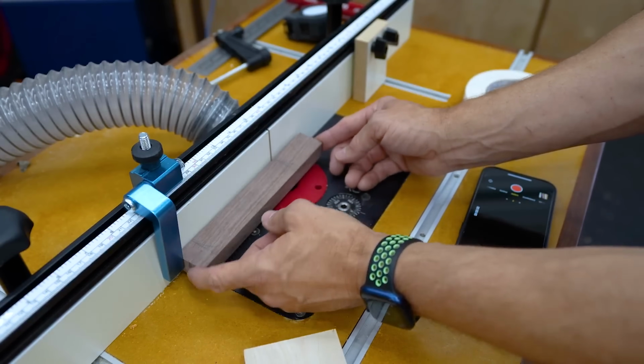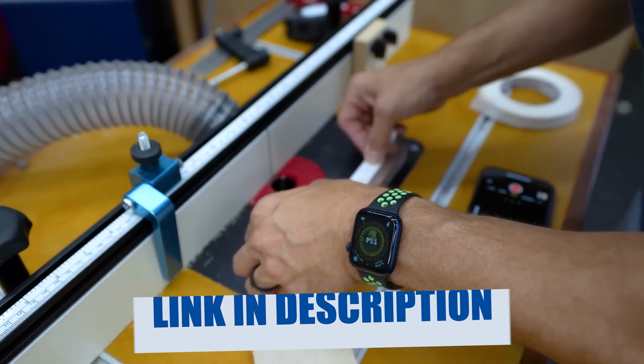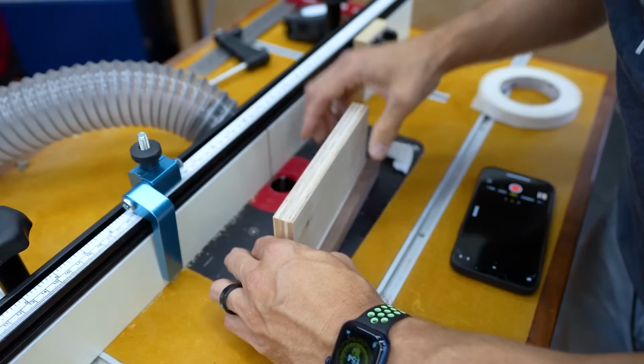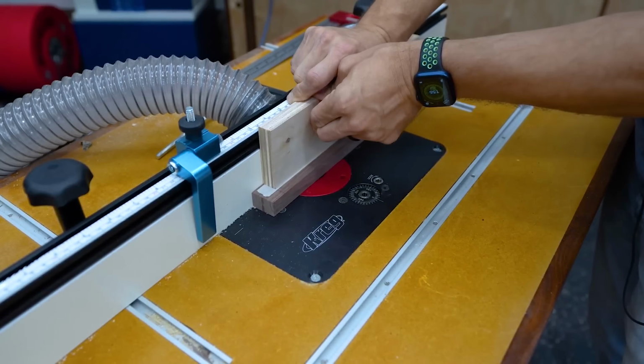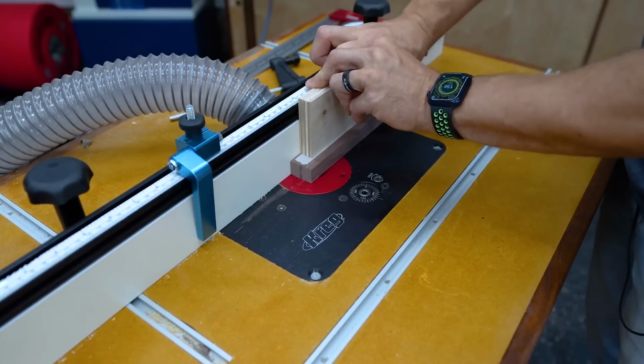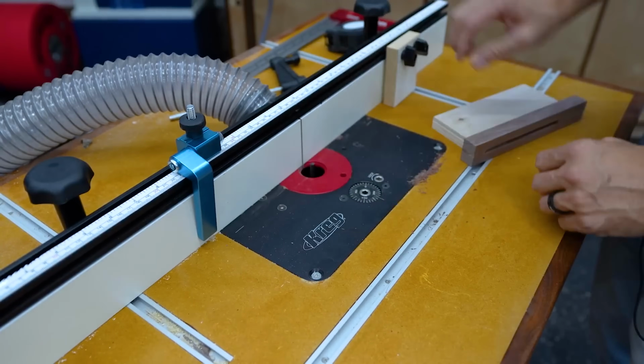From there, all you have to do is get some double-sided tape. I like this tape here, I'll link to it in the description. And then you'll take a piece of scrap, in my case a piece of plywood. All you have to do is put the board against the right stop block, ease it down onto the cut, and then move it all the way to the left until you hit your other stop block.